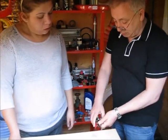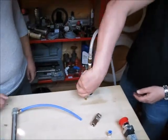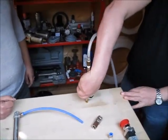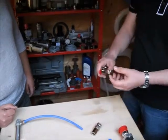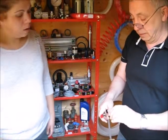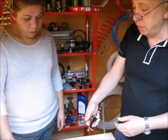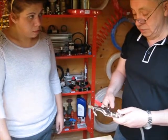If I put that up against my arm and press — the air blows out the side. That's a safety feature called a safety nozzle. You can get longer ones with more holes and more pressure. You have to be really careful where compressed air is concerned.